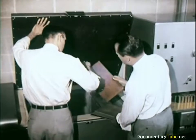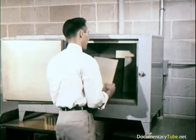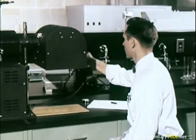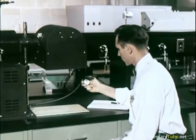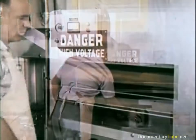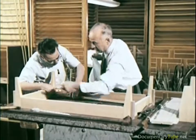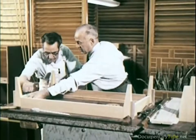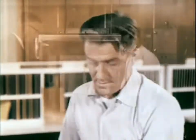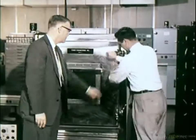All these materials undergo initial testing to make sure they are able to withstand normal wear and still retain their beauty. Samples are put into freezing chests for a period of a half hour or more, then immediately put into a heat oven for a similar period, after which they are closely inspected for any tendency to shrink, warp, or swell. Paints and plastics are examined under ultraviolet lights to check their characteristics and make sure they will retain full color and luster. When all components have passed quality tests, the go-ahead is given to build a prototype cabinet. In RCA Victor's own cabinet shop, skilled cabinet makers help bring to reality a handmade prototype. After the test finish is applied and is hand rubbed, the completed cabinet is ready to be tested as a unit. Even though each part has been individually quality tested, they are again tested to make sure they do not lose any of their quality characteristics when assembled with other components.